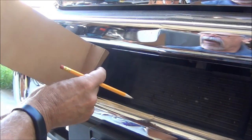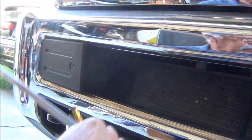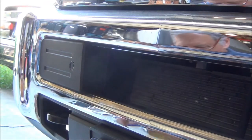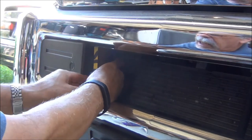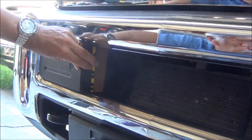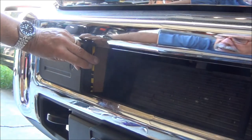I'm going to make a second template that doesn't have these second bends in it so it's more uniformly shaped. The strip I'm using is a half an inch wide aluminum strip, and I'm going to make the frame width also a half an inch wide on this last cut. Now this should fit like that, so that'll be the main bracket — I'll have one on each side. I'll make a mirror of this for the other side and then I can start figuring out the framework.